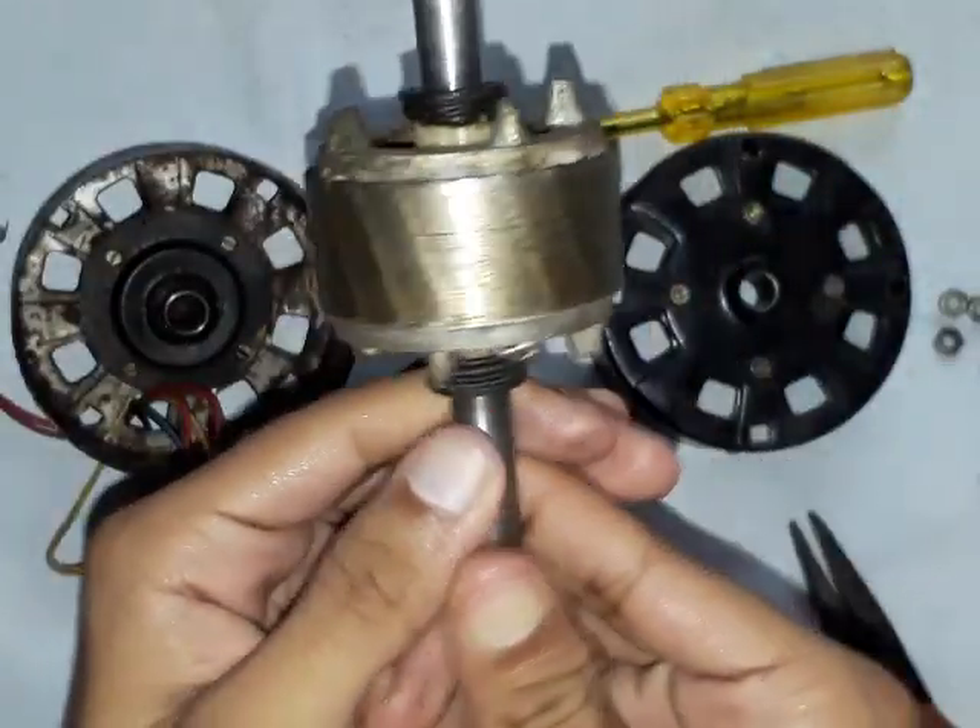I will connect this terminal to the transformer, and this one I will connect to one end of the capacitor bank, feeding to the terminal of the auxiliary winding. Now let's power the transformer — see, the motor is rotating! See, the motor is rotating.